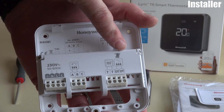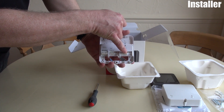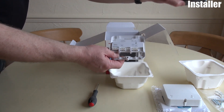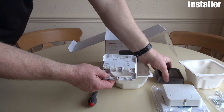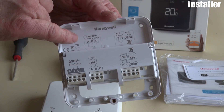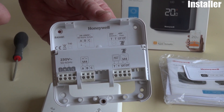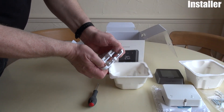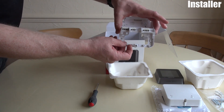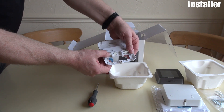The big change here you'll see is the wiring configuration. Starting from the right, we have two connections for OpenTherm connection to OpenTherm compatible boilers. The next two terminals connect via a wire to the thermostat head itself. The next connections along are your switched connections for the boiler firing — be that low voltage or mains voltage. On the left is the mains connection input. A nice feature is the flip-up panel on the front — when you're mounted on the wall, just flip the terminal up, strip the wires like this, feed them in, tighten them up and clip it back in place.